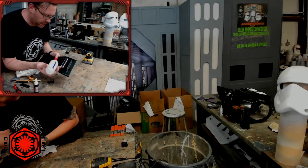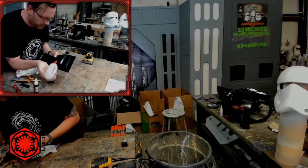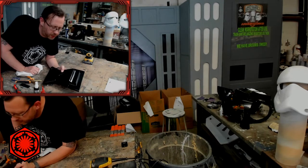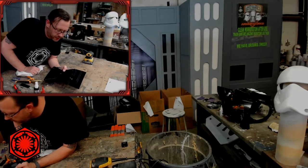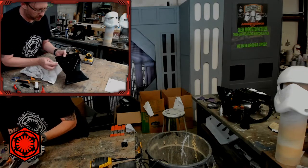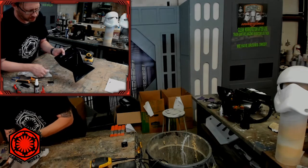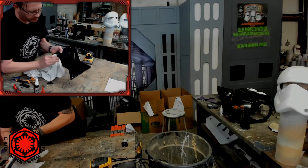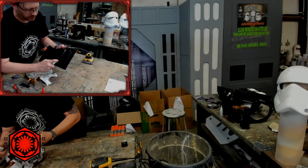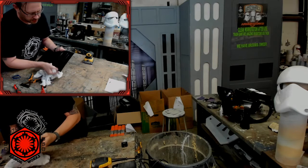So that was second application on that side, this is second application on this side. And when you're applying this heavy, yes, sometimes it can stay uncured underneath it because it is degassing. When I'm doing that, I try not to touch it too early. If I do, don't touch it with your fingers. Just get a quick wipe off and then spray it again if anything came out and wipe it off again. And that should take care of it. This side should be cured. Maybe demonstrate that right there. Yeah, same deal. So we filled the gap.